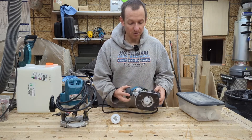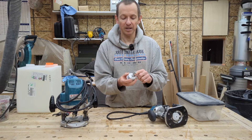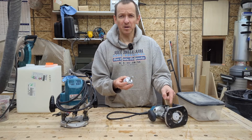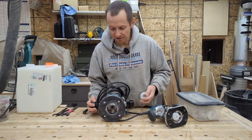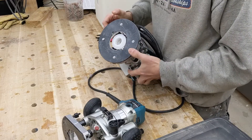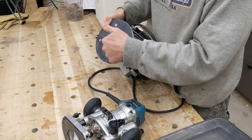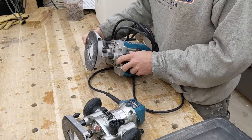Since I only use these two smaller fittings, this larger driving tool has a half-inch shank, so you can't use a trim router on these because those only have a quarter-inch shank. This one actually fits in my larger router and, as you can see, it can clear this base. That makes it nice and stable because even with this bigger fitting, I can still use this plunge router to install my fittings.